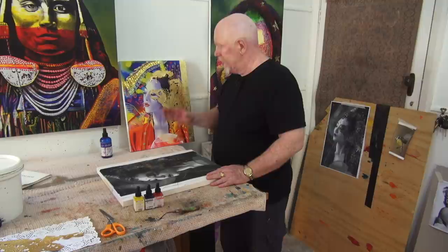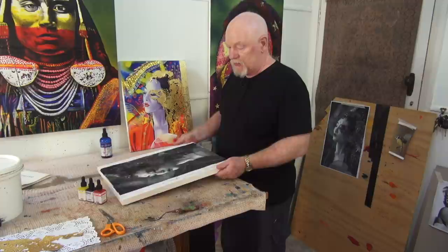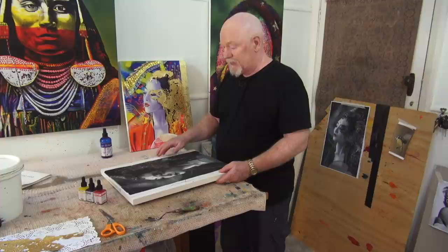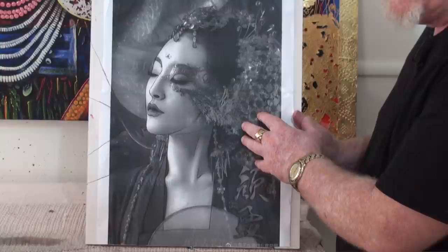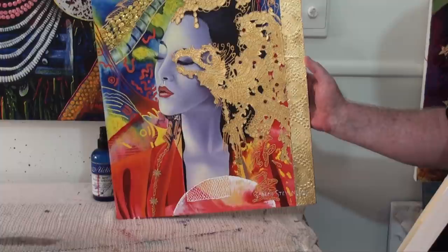This is where we're heading today in the finish process. It could be more complex, but this illustrates how you can approach these pieces. We're putting this onto board, because if they're quite large and you put a two-pack solution on them at the end, they can actually sag in the middle, so you've got to be careful with the surface you work on. I found this picture on the net — it suited the process of what I wanted to do with the gold leaf and the cutouts. I've carboned this onto the piece, and there's also a section at the side I'm going to gold leaf.